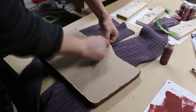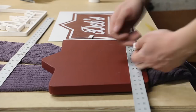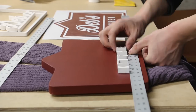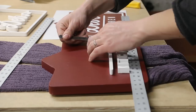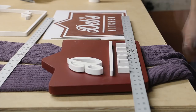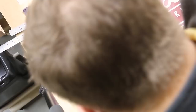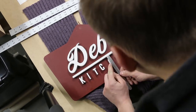With the paint dry, I screwed the hook on the back of the sign, then started the glue-up process using PVA bookbinding glue. My process for getting the letters in place was basically to go back to the original printout, find a reference point, measure from there, and then transfer that measurement to the wooden version. I got the letter placement as close as possible in a dry run, then glued the letters down for real.